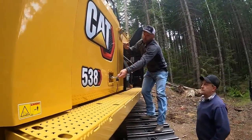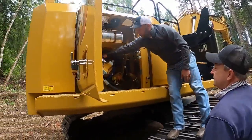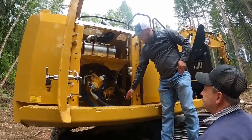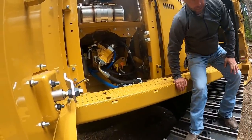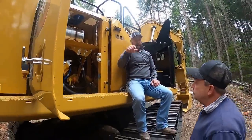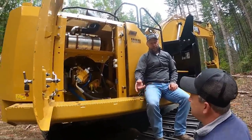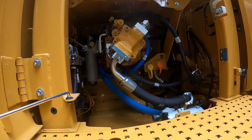So on this side, you have a ground level oil check. And right here, you have the same thing up top. When you're up top as well, this is your hydraulic vacuum pump. If you lost the hose or something, I'll show you in the monitor where you can get to that. You're literally going to hit enable, and it's going to activate. Ideally, you shut the machine off, gear back on, hit that, and it should hold that pressure back.